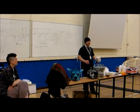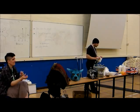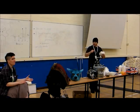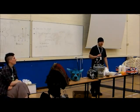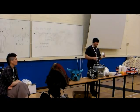It will be exactly how you left it. The silicone comes as a goop, and then you add a catalyst, you mix it together, and it can be any viscosity from tomato soup to water. You can also get the spreadable stuff. You can get extraordinarily thin silicone, which is really good for high detail, but just go for the cheap stuff.